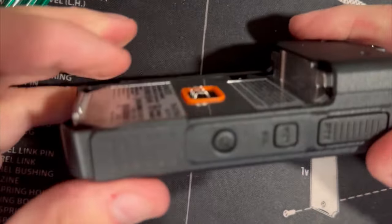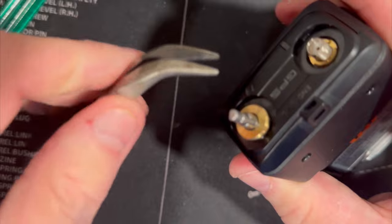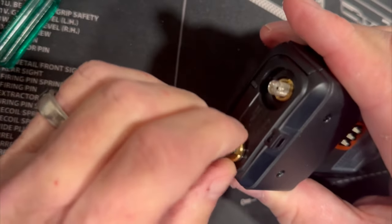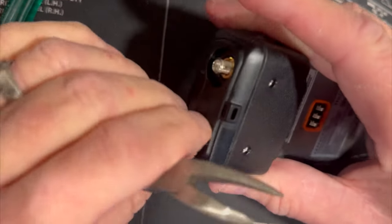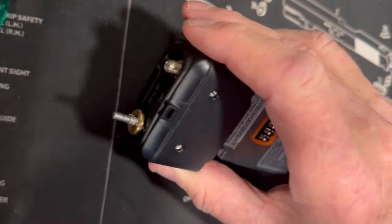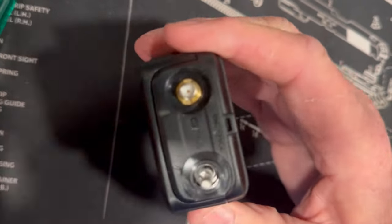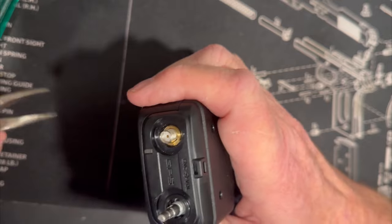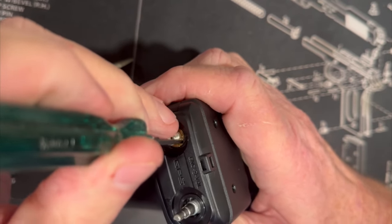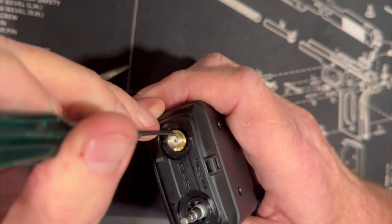This one here is the antenna connector. A spanner wrench is what you need, but you can use hemostats or curved needle nose pliers like this and you just loosen it up. Be careful not to strip the threads — I've loosened it, then I just take a small flathead screwdriver and twist it off.